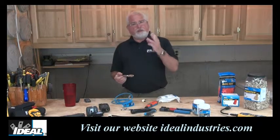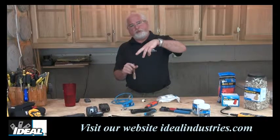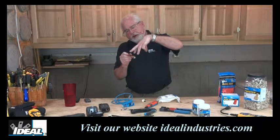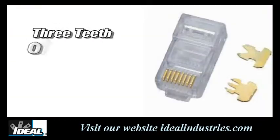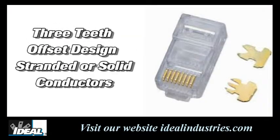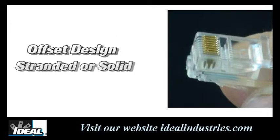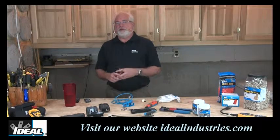The best pin design for solid is where they add a third tooth. You can closely look at the pins and see that third tooth — they're offset, and when it bites into a conductor it bites through the outer parts, not the middle. That's why a plug designed for solid can actually work on solid or stranded, whereas a plug designed for stranded can only go on stranded conductors.